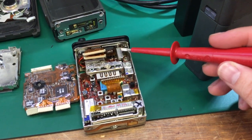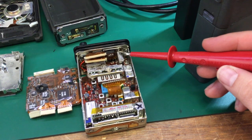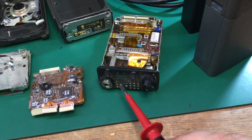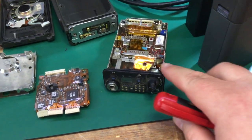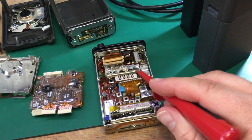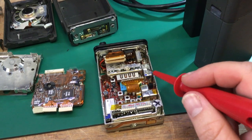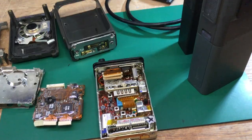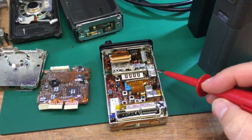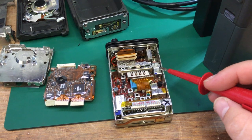That's the pin diode switch module. When you connect a remote speaker microphone or external antenna adapter to the top of the radio, you short two pins in the adapter plug, which switches the pin diodes so that RF is routed in a different path to the external antenna pins on the top socket. These two helical coils are for the receiver front-end adjustment, tuned for maximum receiver sensitivity performance at the mid-frequency of the entire band.